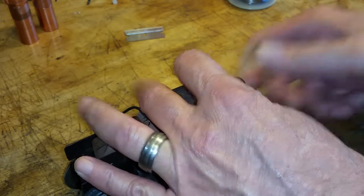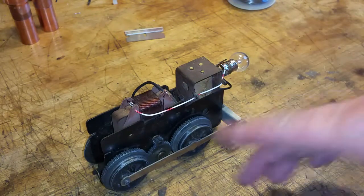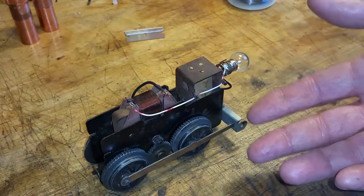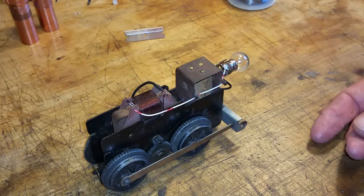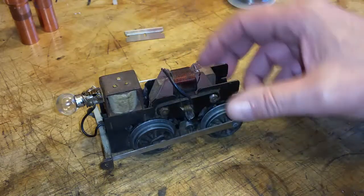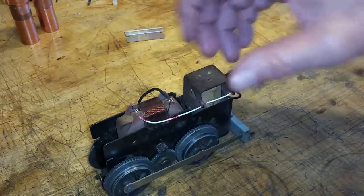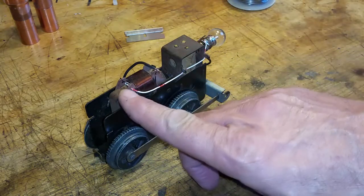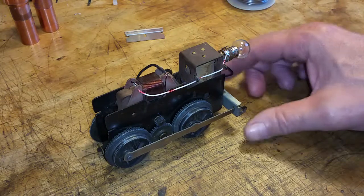And it does work. So I just did the bypass on this motor. And again, if you get a motor, because when I got this, you put power to it, the light bulb would light. That was it. It didn't even buzz. Deader than a hammer. So when you encounter these things that are in that bad a condition that it won't even buzz, just cut the wires going from the E unit to the coil and the brushes. You run a power line to this side of the coil, you run this side of the coil to the brushes, motor's fixed. That simple.